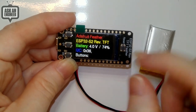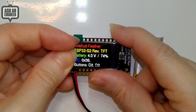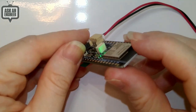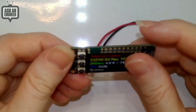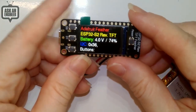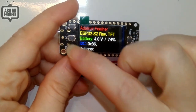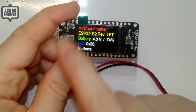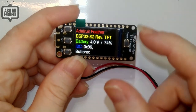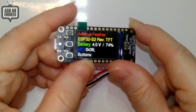Here's the demo running on battery. It shows I2C devices, the I2C address 0x36 for the built-in battery monitor, the reset button, and the D0, D1, and D2 buttons. There's also a vertical STEMMA QT connector — it's oriented vertically so cables come out the back. There's a footprint for a BME280 sensor but we don't actually place the chip — it's a vestigial sensor pad.